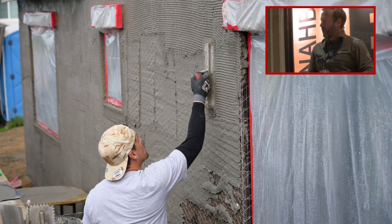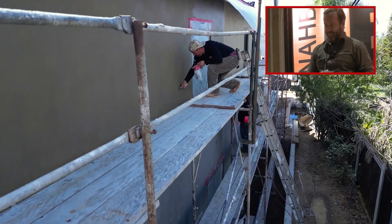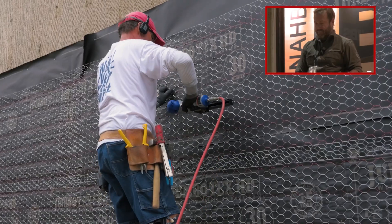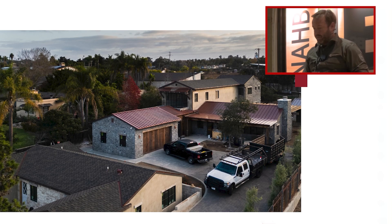These are all things you have to pre-plan for when you're working in this. We did a three-coat system — this is our scratch coat, they came back and screened it, and there's our finish coat going on. That gun is shooting out two and a half inch staples. We went for a very earthy tone, and you can see all that movement you're looking for in a Santa Barbara finish. You can see the lintels at the top — everything flushed out. The stone and all those lintels flushed out because we planned for that, setting them at different depths. The stucco section got the three-coat applied.